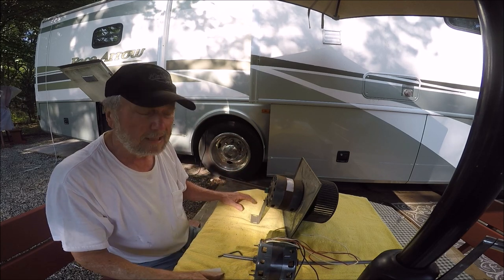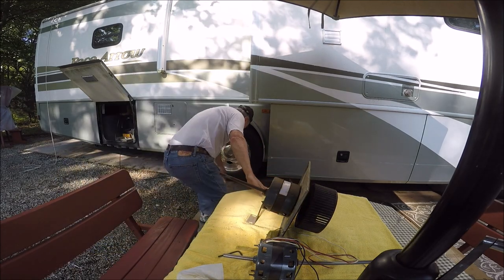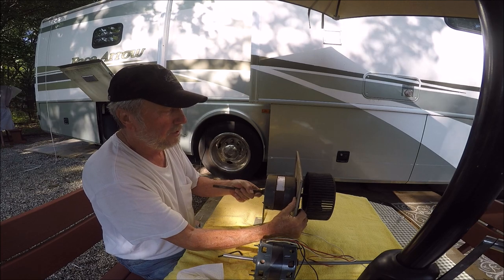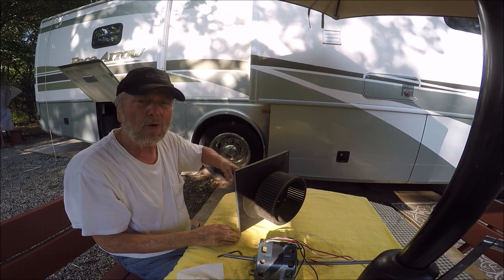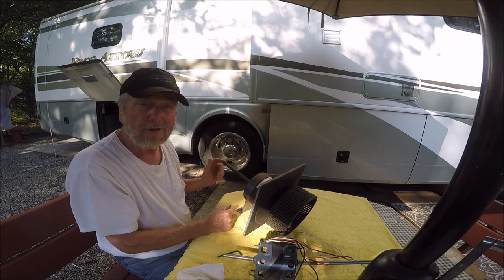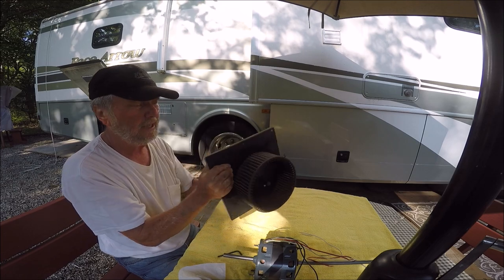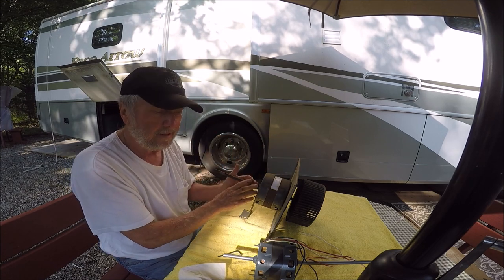You'll still have the pigtails on there and be able to easily identify them. You may have to use a screwdriver because it's a little stuck — a gentle little prying will pop it loose. Once it's popped loose, move it a little to the left and between the individual blades you can pull this right out of the hole as one solid unit. Just be careful and don't shove this into your evaporator coils or you'll have a new problem. If you're on top of the roof, wrap something around a rope and lower it down to the side.